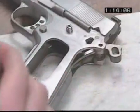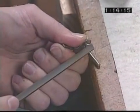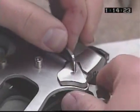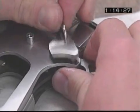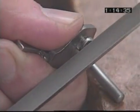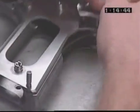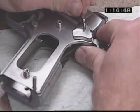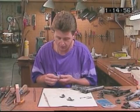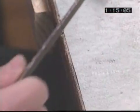And it's still, you can see it's put a wear mark right back in the same place. It's bearing down pretty heavy right there. Now it's starting to feel a lot better. You can always tell where your wear marks are. How's that feel? You can still feel quite a bit of tension on it. At this point, when you get that close, you really just need to take one file stroke off at a time to make sure that you don't get too much cut off of it.